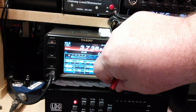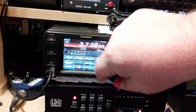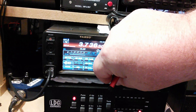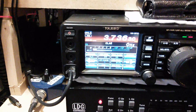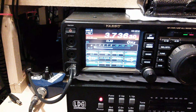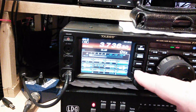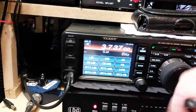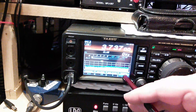Always make sure as soon as you've done it and tuned on the band - I'm using an auto ATU - straight back down to 8 watts again. Once it's back down to 8 watts you're ok. That's already tuned. Mode LSB. I've checked there's nobody on the band, on this part of the band anyway.